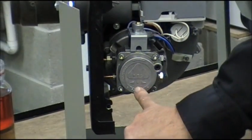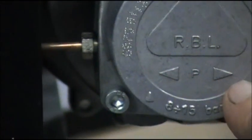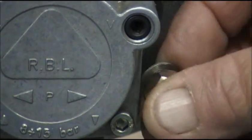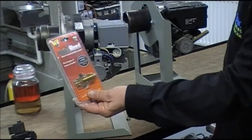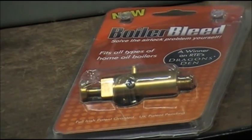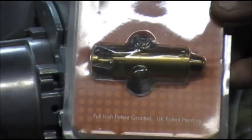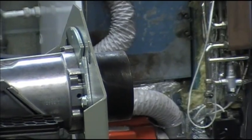Looking at this Riello, very similar setup as well. On the front of the pump, you have P for pressure on both sides, indicating where we put our bleeding equipment — either a pressure gauge or other tools on the market. One is called a boiler bleed, which was actually invented by one of our technicians who trained at METAC. It's a very simple idea that fits all types of pumps because the thread is universal, and it helps the homeowner bleed their own pump safely.